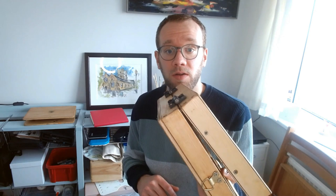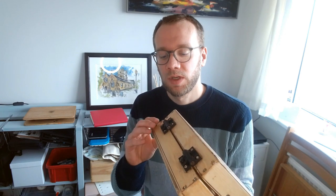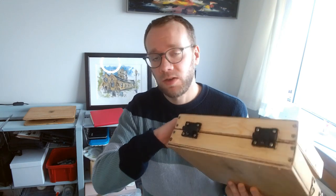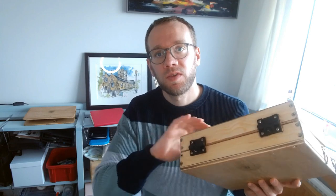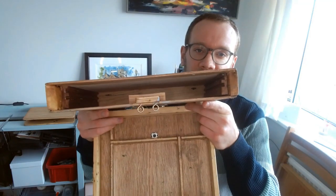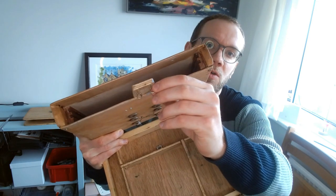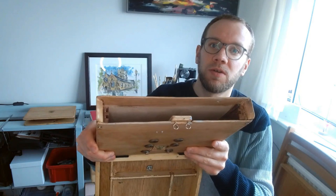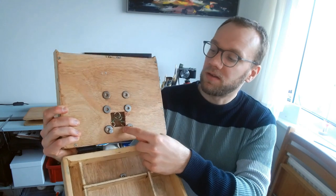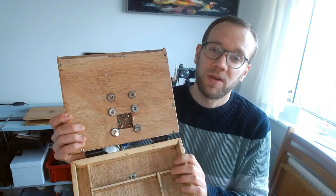The torque hinges are the special bit in many ways. Those you have to buy from specialist shops or you can get them on Amazon — there's a link in the description below. They do just screw on simply, and then you can tighten or loosen them so they can take more or less weight or be easier or harder to open. Inside here are a couple of fiddly bits. You've got the thing which holds down the panel — that's simply another piece of plywood or strip wood with two eyelets, and then two eyelets at the bottom on another little bit of wood. I've just got a rubber band holding it down, but there are loads of ways you could do that depending on what you have.